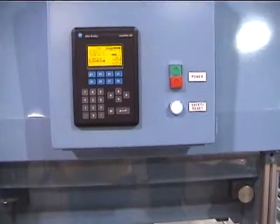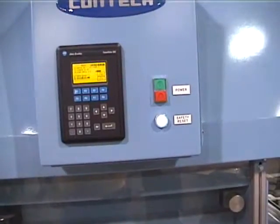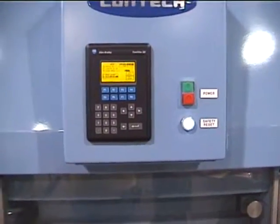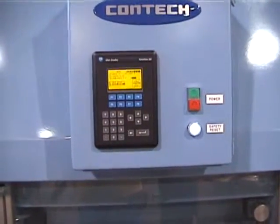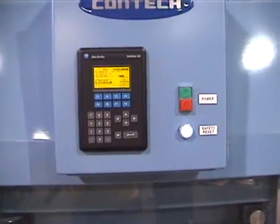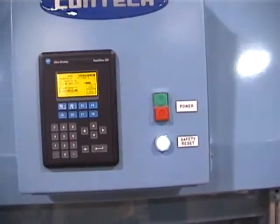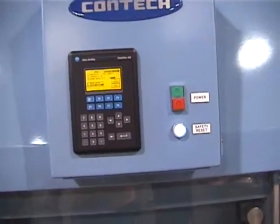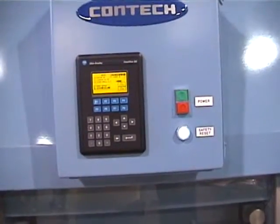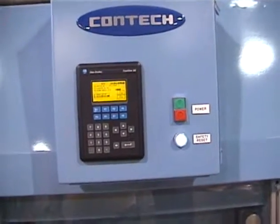You'll be able to set your batch, your speed, your down dwell — all that through this control system. What I'm going to do next is show you the differences in those cut tolerances like I talked about, and I'll be sending those samples to you. Keep in mind I was doing an increment length of 11.25 inches and a batch of 20, so I've run quite a series of parts. That way I can show you what that variance is.